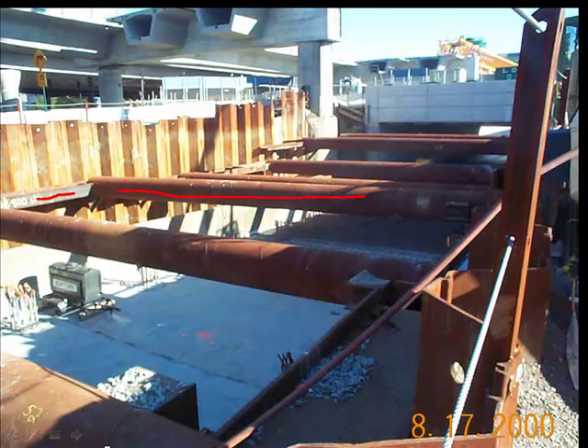I've also had occasion where I've added cover plates, top and bottom, to the pipe strut in order to get it to span the required distance. In some cases it is even necessary to introduce intermediate supports because the distance is simply too great. The drawback is that intermediate supports will no doubt interfere with construction inside the excavation. The engineer must decide whether to use tiebacks — which create an open, obstruction-free excavation — or pipe struts, and determine the most efficient spacing and when intermediate supports are needed.